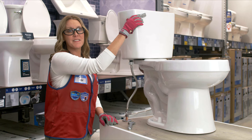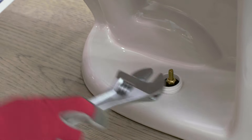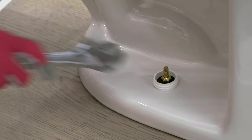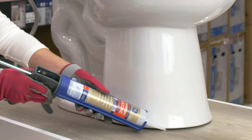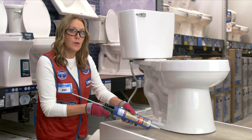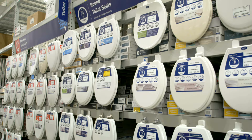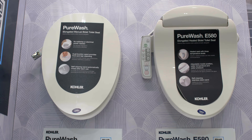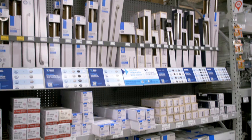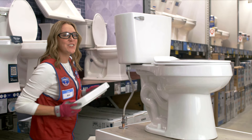Flush the toilet a couple of times and check for leaks around the base. If it's leaking, make sure the nuts are tight. If they are and it's still leaking, you'll need to reset or replace the wax ring. You can caulk around the base, but you might not notice leaks if it's sealed. Some local codes require it, but allow you to leave the backside open. Your toilet will include a seat that installs with a screwdriver. If you're looking for an upgrade, Lowe's carries a variety of seats to fit different toilets — some have slow-close hinges, taller seats, or a built-in bidet. You can also find Lowe's livable home products to make your toilet more accessible. Finish by setting the top in place and the installation is complete.